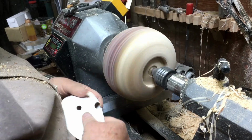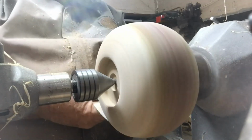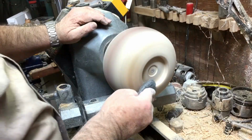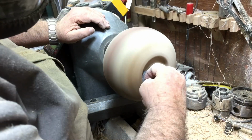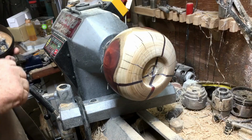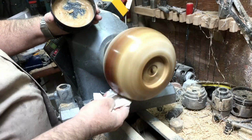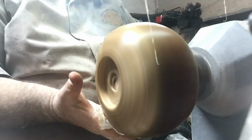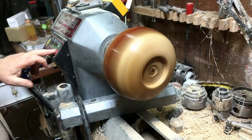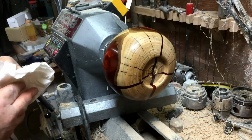I'll be very honest with you, I found out that chestnut is very similar to oak. It's not a nice wood to work with, so I started sandpapering from 80 all the way to 400, and then I'm using metal wool to clean it a little bit, so I can clean it more on the side of the resin. Yorkshire grit, of course, and then I'm going to use a new system that I learned on YouTube, and I'll tell you all about it in the second part.